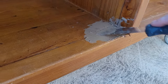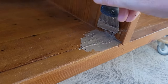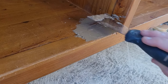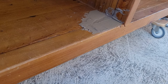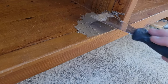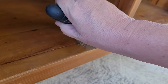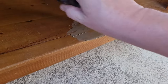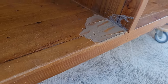I'll overfill it a little bit so there's room to sand it off without it dipping. Sometimes, same as when you fill drawer pull holes, you need to run over it a couple of times. But I'm not going to bother here — this wasn't really something that needed doing, I just thought I would while I could. Whatever result we get is going to be better than it was originally, so I'm happy. That'll be dry in the morning, ready for sanding.